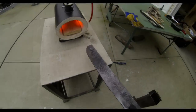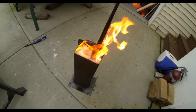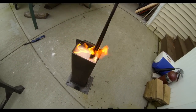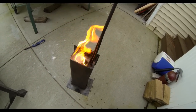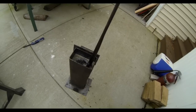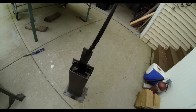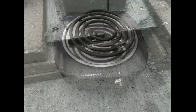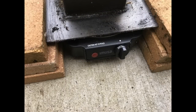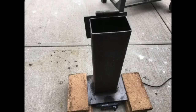You're also going to need a forge or some way of heating up the material, and you'll want to preheat the oil. Best case scenario, the oil should be preheated to 120 to 130 degrees. You can do that by heating up a piece of steel and sticking it in the oil, then stirring it so it's the same temperature from top to bottom. Or you can use an electrical burner — I got mine on eBay, very inexpensive. If you use a burner, be very careful: make sure the oil reservoir is secure and won't tip over, as it's definitely a fire hazard if it did.